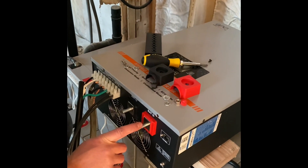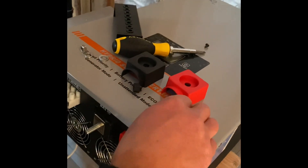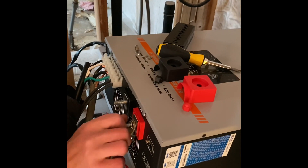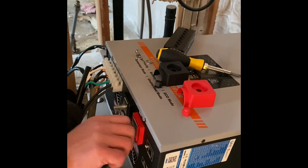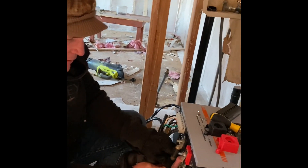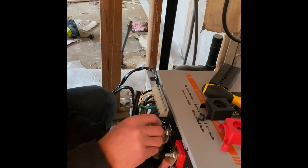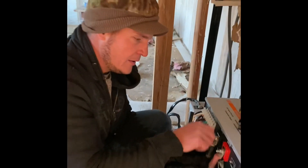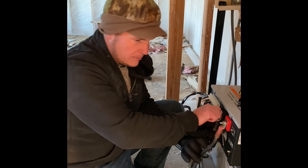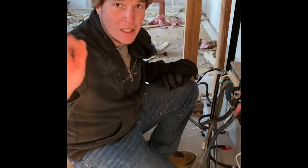When you first touch the batteries, it's going to spark a little bit. We're going to put the hot on first. There are capacitors in here, and when they first light up they're going to spark, so you want to keep your face away from it. Just a little pop. This is a 220 inverter, so it's going to need 220 AC input. That's how we turned our 12 volt battery bank into a 48 volt system. Thanks for watching — please subscribe.